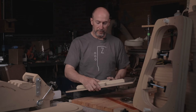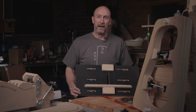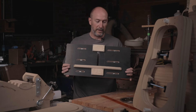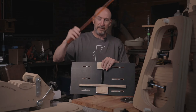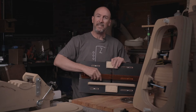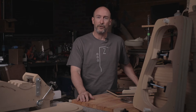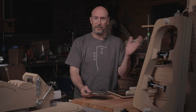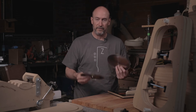We are also developing a handful of other products that have been abandoned since LMI went out of business. One is what we're calling the fret sled. It's similar to what LMI had but different in how it works — there's no spring-loaded contraption. It's actually very much simplified: there's a pin and a template that goes with that pin, and you slide your fretboard along the fret sled and cut each of the frets individually. We'll also have zero-fret versions available — it's about a six-thousandths-of-an-inch difference in how the nut situates relative to the first fret.